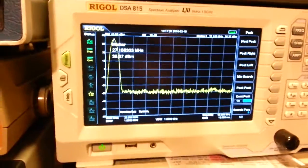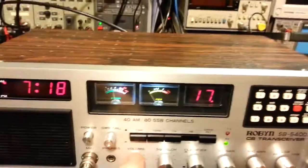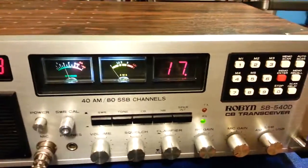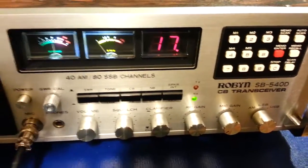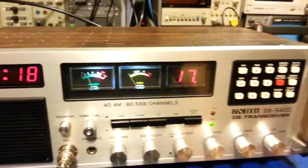It's a good, clean working radio. I can switch it over to an on-air antenna. That's one of the locals — Hot Rod. This has a fairly effective noise blanker. It works really well on signals that are just barely above the static. If you have the noise blanker off — which honestly acts more as a noise limiter, like an ANL — for a signal you can barely pick out of the static, turning it on clears them up really nicely and makes them clearly legible. That works really well on these radios; it was a fairly good design.